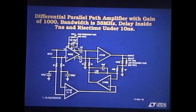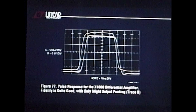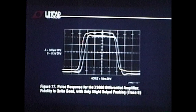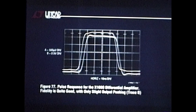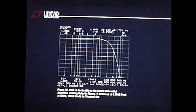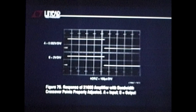The cascade here is a gain of a thousand. We lose the DC and low-frequency end because of the AC coupling, and we're going to have to get it back with a complementary roll-off into this differential-input, single-ended-output slow chain. The name of the game when you break up the high-speed and low-speed channels is how good you are at matching both the gains and the roll-offs. The response is clean at 500 microvolts input per division, half a volt out, with very little phase and just a touch of peaking, visible as about a quarter dB out toward the 35–40 MHz 3 dB roll-off.